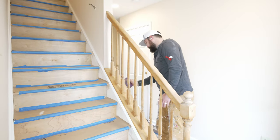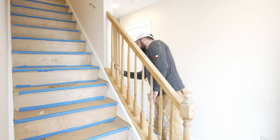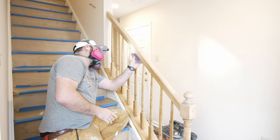Before I get to that product, we've got to prep the surface a little bit before we start applying anything else. You want to use either 150 or 220 grit sandpaper and just give it a good sand. Try and sand with the grain as best you can. Particularly if you are sanding polyurethane, you want to make sure you're sanding it quite thoroughly. Then once you're done sanding, you can wipe that off with a rag and we're ready for the next step.